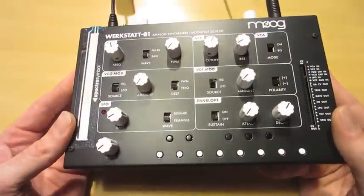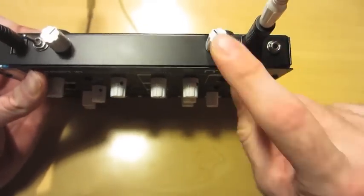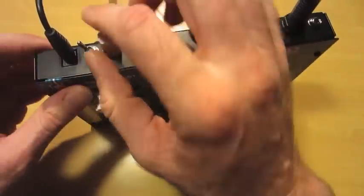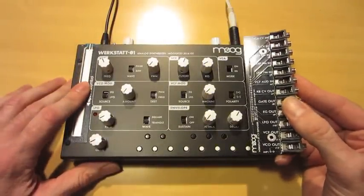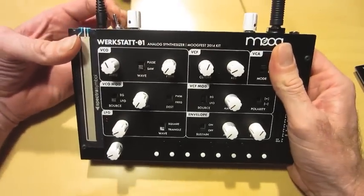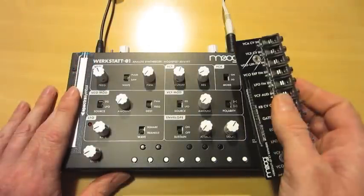I think I am all done. Got the bottom keys all changed out to white, added white knobs to all the current knobs, added the volume pot, the gate input, and the pitch bend — this toggle, this pot, and the soft pot. I did have to change out the pot here because the pitch bend does not really work when I plug in the CV expander, which is kind of a bummer. But my workaround, I put a different toggle in there — one that has a center as off. So now all the way to the left is pitch down, center is off, right is pitch up for the soft pot. I'm just away so I can disengage that when I want to plug in the CV expander.